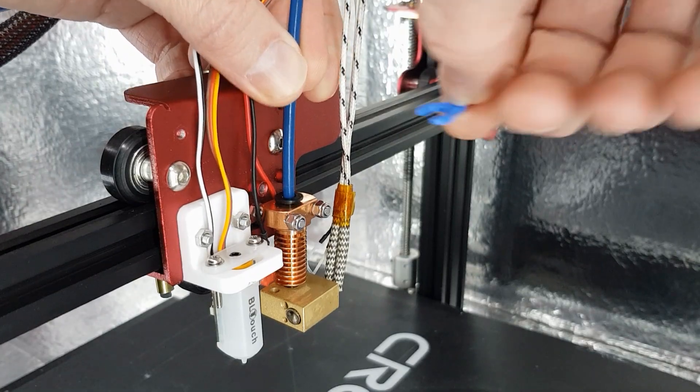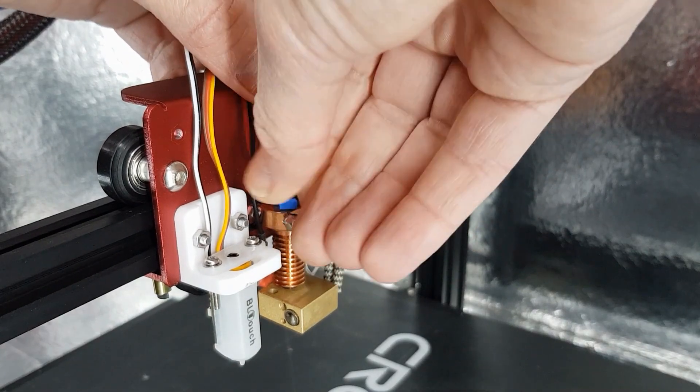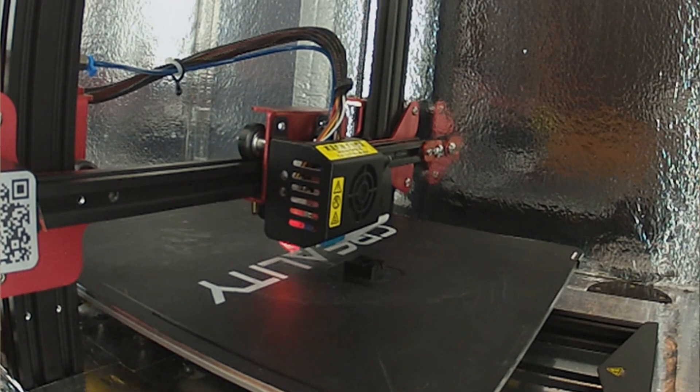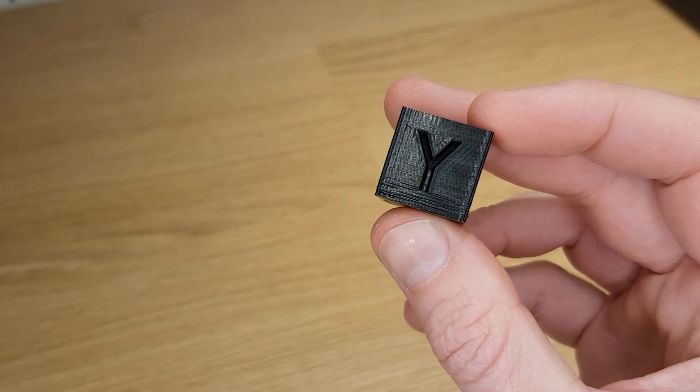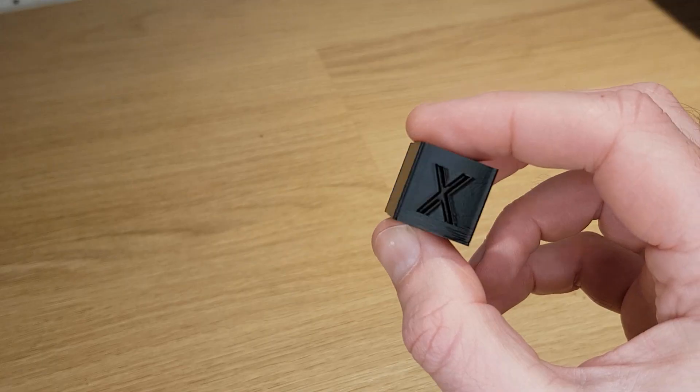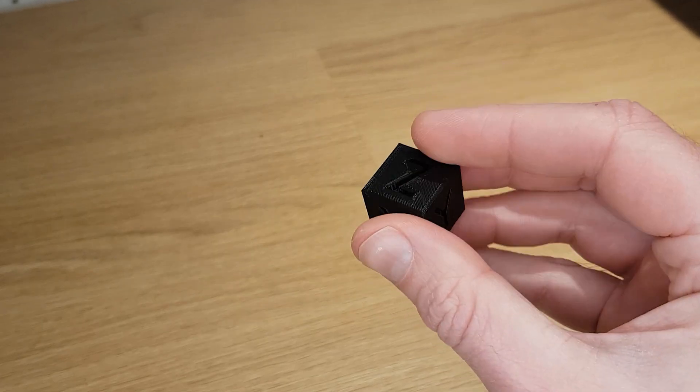With all that done it's time to try it out. With an all-metal hotend, feeding in the Bowden tube is far less critical and it's only really there as a guide for the filament. I'm starting with a completely stock Cura standard quality profile and using PLA to print a calibration cube. In the first four millimetres or so the layers look a little inconsistent, but after that it's very neat. There is some ghosting which can probably be tuned out, but I don't see any issues pointing to a hotend problem and there's no sign of under extrusion which might indicate a clog or insufficient hotend cooling.